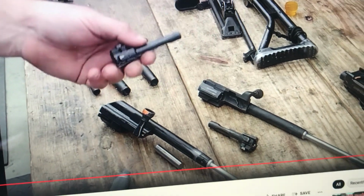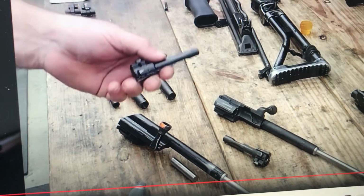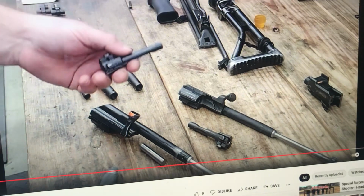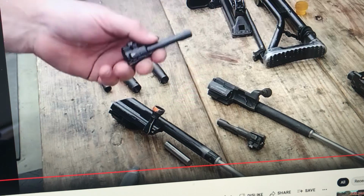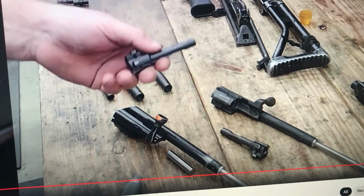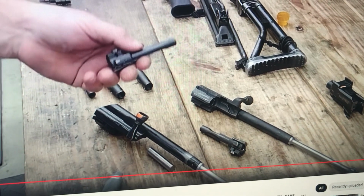This whole video, in my opinion, is created so he can show the people that he's built these guns for that are having these issues, and try to blame, oh, if it ain't the bullet guide that's wrong, it's your bolt carrier that's wrong. Oh, here, send it in. We're going to have to fix it. Oh, okay, here, that's an $800 fix for you. When all he's really got to do is just take that bullet guide out, mill the receiver to IMI spec, put an off-the-shelf IMI bullet guide in it, no grinds on it, and rivet it back in, and it would work just fine, in my opinion.